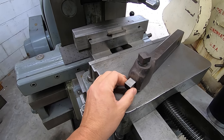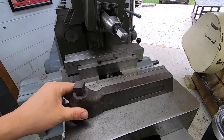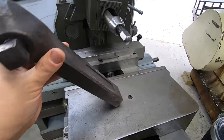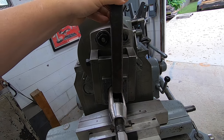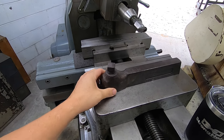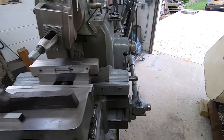That is cool. So I got this for the shaper right here. I'm gonna have to take a 16th off of this side right there so that it will fit in the lantern. It's about 75 thousandths too wide right now. I thought that was cool. That showed up yesterday, so I just had it sitting here. I'm gonna clean it up, make it look pretty. Just thought I'd show you that since we were walking by.